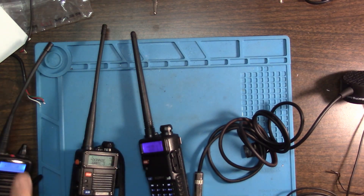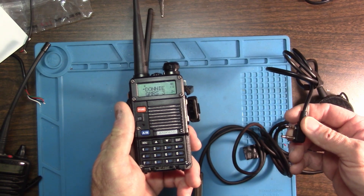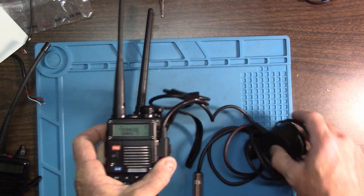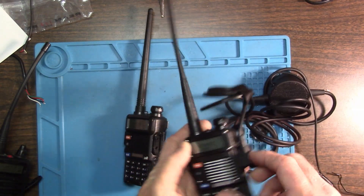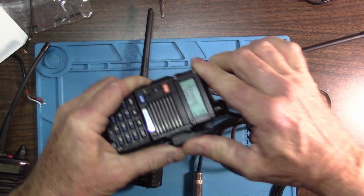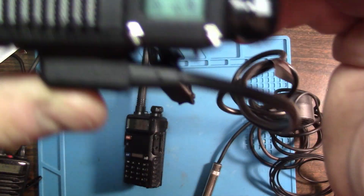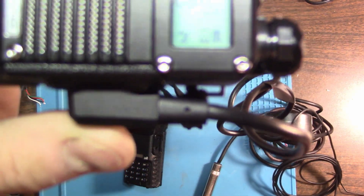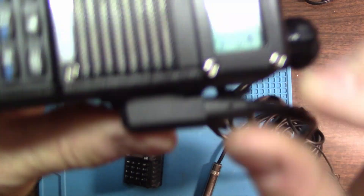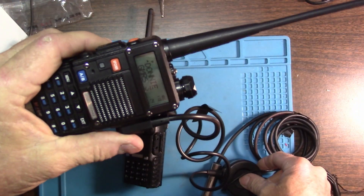This one doesn't talk to me. This is a UV5R - well, let's just show you - this is the radio they sent in, it's a BF-F8HP. So when I plug it in, it's not keying the radio. They sent me a video showing it doesn't key the radio. I might be able to get it rammed in there, but it's hard to get these plugged in all the way. Not keying the radio. If you look really close, it's essentially touching right there, and that little bit of touching - it's just not seating the pins all the way.